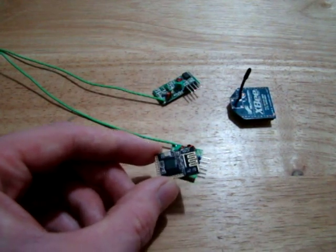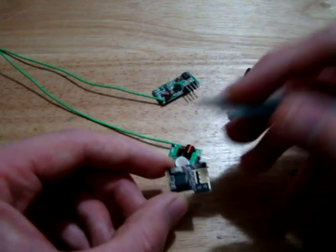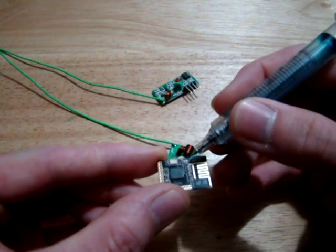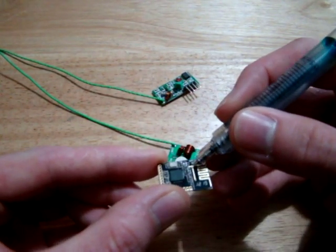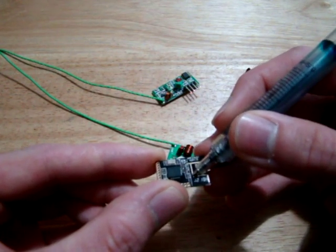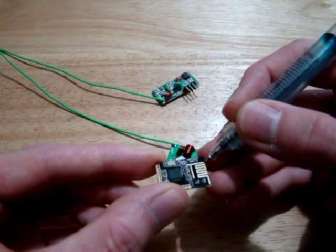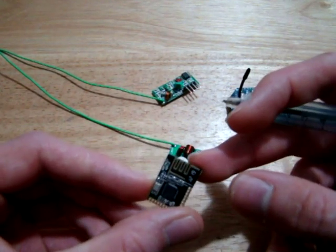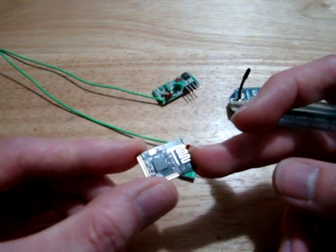Now, we're just talking about antennas. Those are monopoles here. This is an inverted F. So it's fed here. This is a grounding stub. So that's a pin where it's grounded, and then the antenna has this meandered structure, and that reduces the length of the antenna.